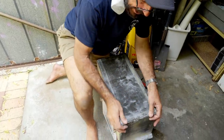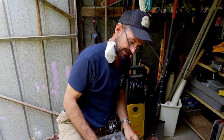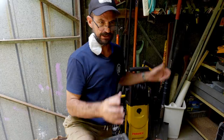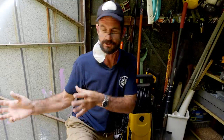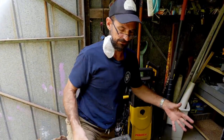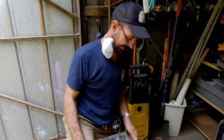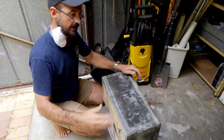That's one thing that's been bugging me for at least 12 months. I was thinking maybe I should have just put baffles in there. Big tanks have baffles because of what's called free surface effect — a liquid can act like a loose cannon. If you have an unrestrained weight on a boat, say a ton, and it's moving, it might do a bit of damage. Fluids are exactly the same. But this is such a tiny little thing — it's less than your average jerry can. Our little diesel uses 700 to 800 millilitres an hour, so it doesn't need a very big tank above the actual engine itself. So what I'll do is clean up everything, clean out the inside of the tank, and re-glass this.